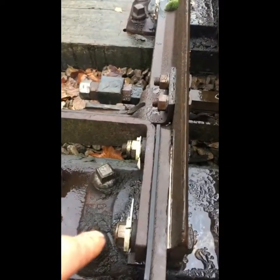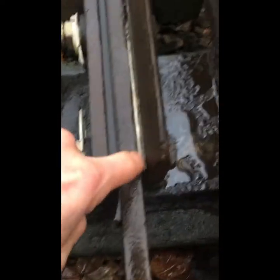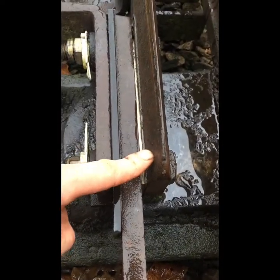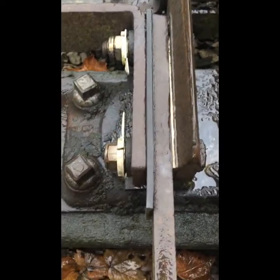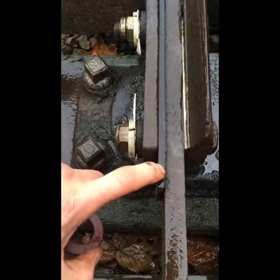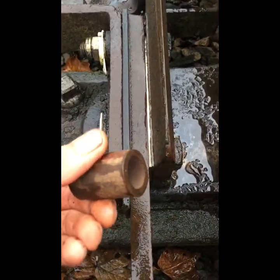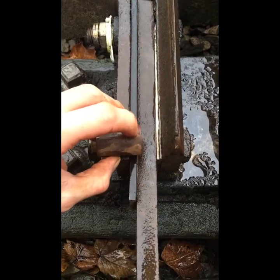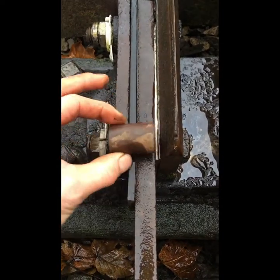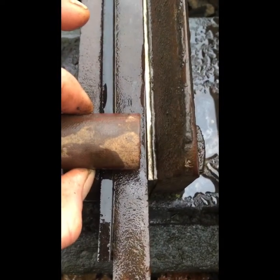The shim is simply shaped with a hole either end, so you can angle it in and tap it down so it clears the two bolts. What you need to be careful of is: if you come to shim this insulated side, the shims must go against the rail — never against the insulated plate, because it will burst through the washer, carve straight through it, and put a short on. You don't want that. The plate at the back is now clear of that ferrule.